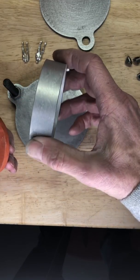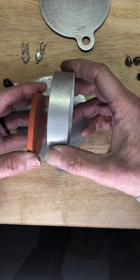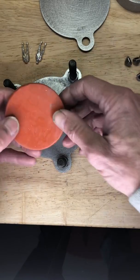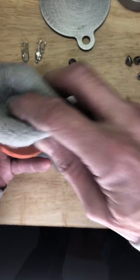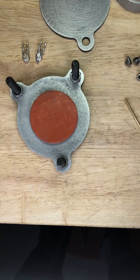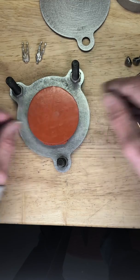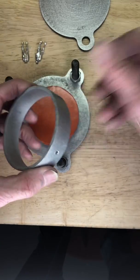This mold frame is three quarters of an inch and each piece of mold rubber is a quarter of an inch, so we're gonna use four so that we have extra above the mold frame. For the first one, we're gonna add powder to the back, place that down, and then the second one is gonna fit right on top of that without any powder.